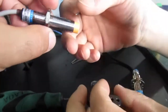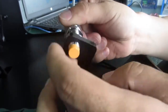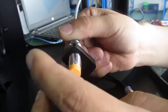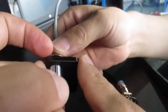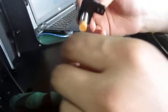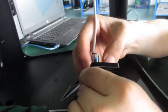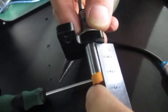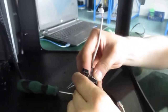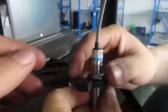Now assemble and mount the orange sensor. You just mount it and the roughly distance from the block to the edge of this orange port has to be around 20 to 25.5mm, so you can use a ruler to make sure. Then just make sure it's tight enough.